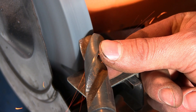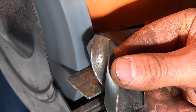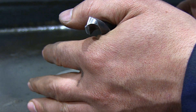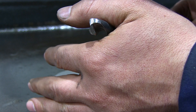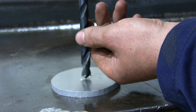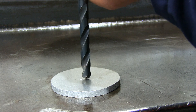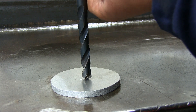Once I see a couple of sparks I just lift off, and when lifting up I'm pushing away and grinding into the heel. If you do a good job undercutting the webbing and sharpening your drill bit, you may be able to use it without any pilot holes. For example, with this 13mm drill bit I sharpened, I'm going to show you on a piece of aluminium — I'll just twist this drill by hand, and because the webbing is cut and everything is really sharp, I'm able to start cutting into the aluminium simply using the force from my hands. If you see ways I can improve my sharpening technique, please write it in the comments.